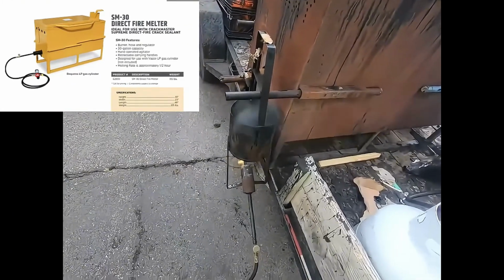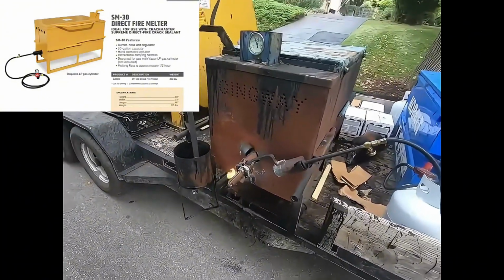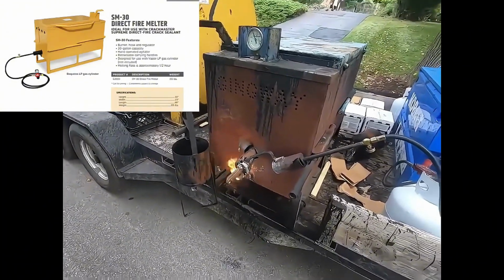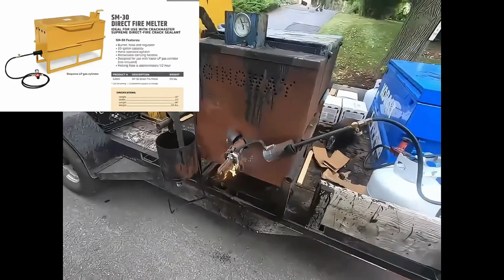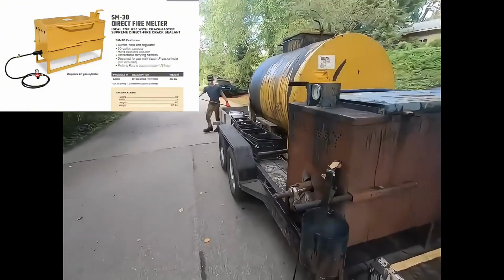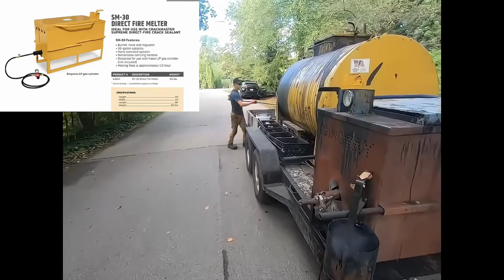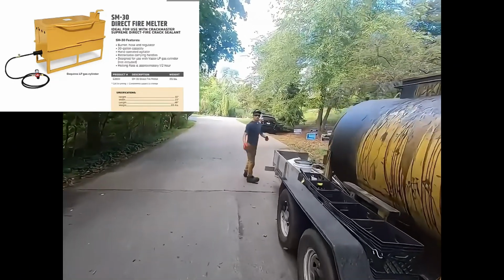And you're going to want to have it so that the valve is sticking out over the edge. They come with handles that you can carry it with. Those handles are great for hanging your pour pots on to heat them up. Remember, you've got to heat up your valve. And you don't want to fill this thing to the top. You want to fill it about 3/4 of the way at the most. You want it to sit somewhere around 1/2 and 3/4. So fill it up about 3/4.